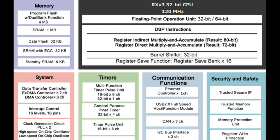You get program flash, which is where you store your code — that's written only once in a while, usually when you bootload or program it. Then SRAM is where you put your working memory while you're working on files or parsing data — your variables, heap or stack variables. It's like your workspace, whereas flash is your instruction or storage space.